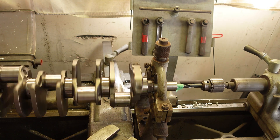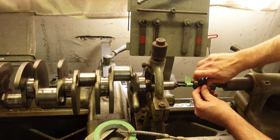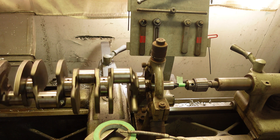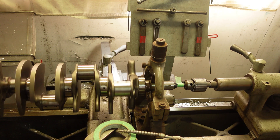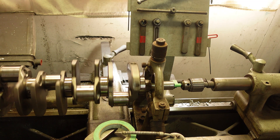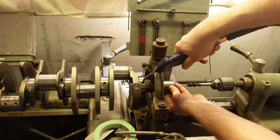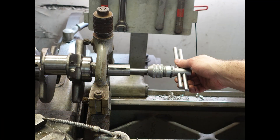Getting that steady rest dead nuts with a dial indicator is what's most important — this hole needs to be square and straight. I got it marked with tape for depth. Once I hit that, move on to the 31/64" drill. This is the one I decided to use for the tap that I had. Many pecks, in and out, blowing out the hole. I started that tap in the tail stock to make sure it was straight about two threads, then moved to a hand tap so I could feel it and make sure I didn't snap that tap off. Pecking with the tap in and out, just like the drill.